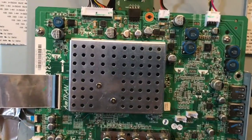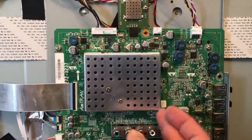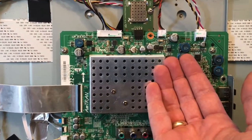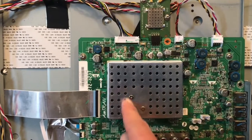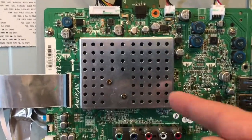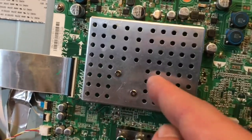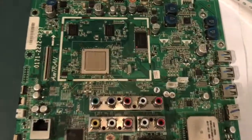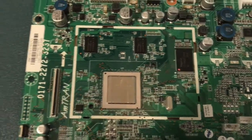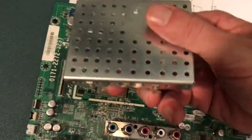What we did differently was use a screwdriver inserted inside, put pressure on the base, and pried it up carefully — ensuring that when you pull the heatsink off you don't pull the ball grid array away from the processor. That was by far the trickiest part. I suggest: take the screws out, desolder on the back side of the board, make sure those are loose from the PCB, then use a heat gun to get it hot and melt the glue, then lift it off. I've now taken off the heatsink on the processor, which is shown right here.